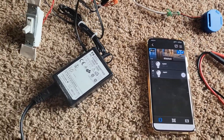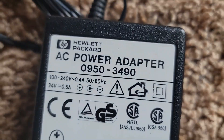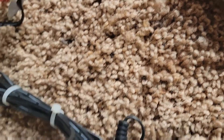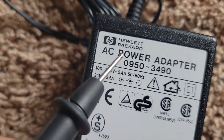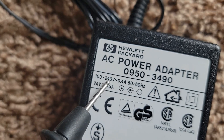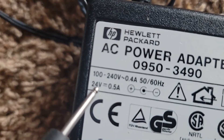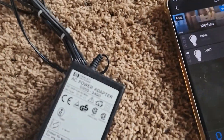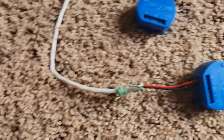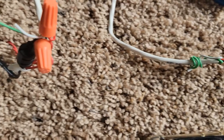I'm a bit of a pack rat and I've got some power supplies. I've got one rigged up just for testing — one for 12 volts and one for 24 volts. This old power supply takes anywhere between 100 to 240 VAC input and outputs 24 volts DC at half an amp, so this works out pretty good. I've got this plugged into the Shelly One.